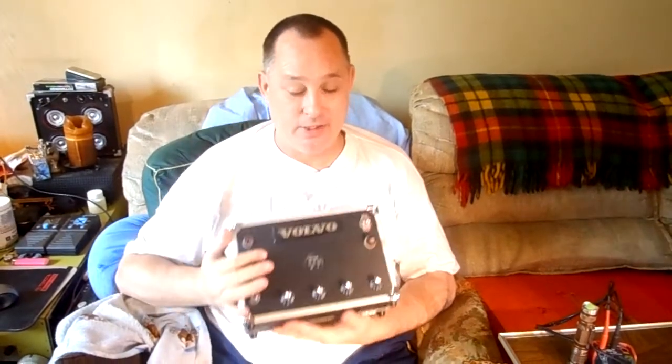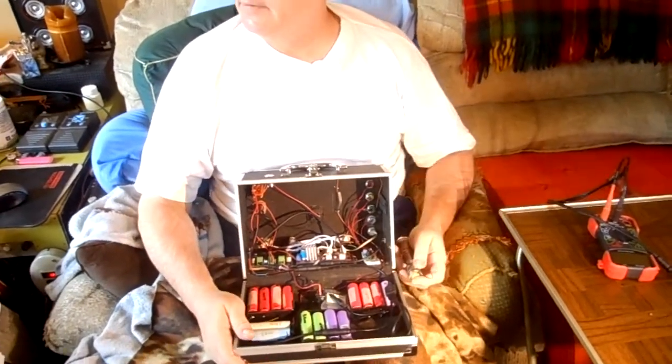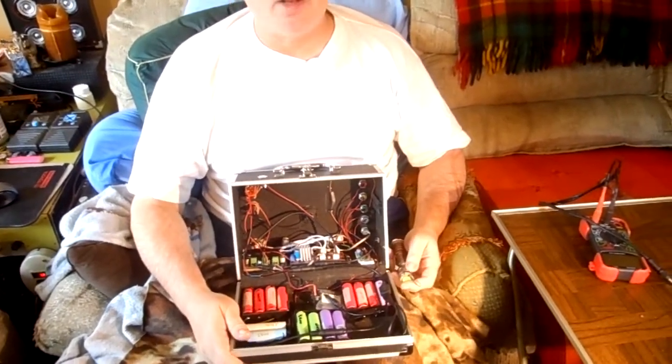So we have this balance control with the other side of this. I gained the input — I combined the input. I wouldn't say I bridged it, I combined them. Bridging means you combine the input to the output. So I combined the input — what do they call that? Mono. Summed mono.